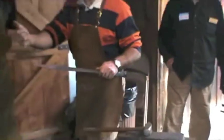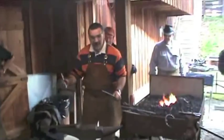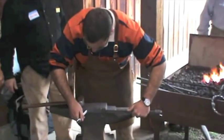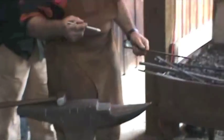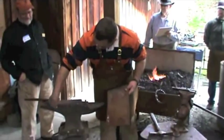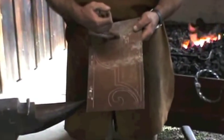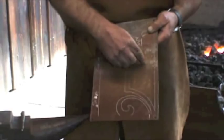So that gives me some mass. I'm going to spread the leaf later when we pedal it, and that gives me some mass to make more of a leaf from by keeping the leaf off the outside. Because I can put the forged scroll on the scroll mark, I can come back — that's the distance of the scroll, that's my nick fold weld, that's the start of my leaf, that's the material I need for my leaf. So I came out here — that's my four and three-quarters of my forged scroll. I then said I wanted to come back an inch and a half. That's where I'm going to nick the bar, fold it back on itself and weld here.